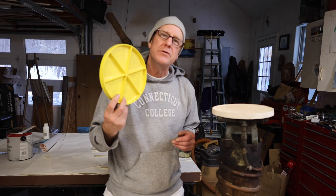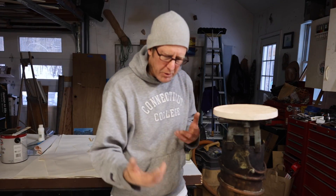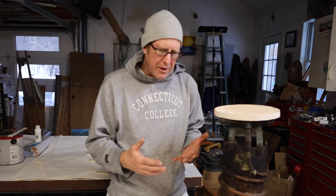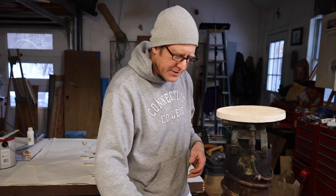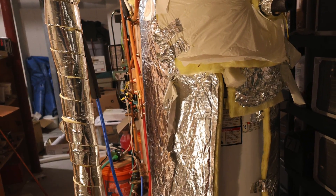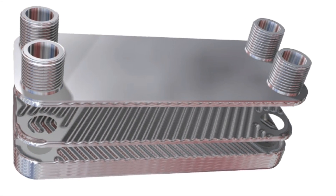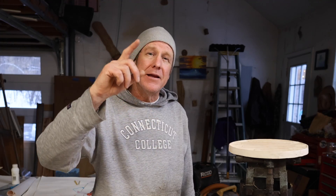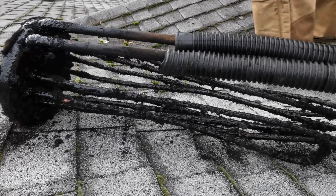This design I've been using since 2014 and I will use it until it breaks or I come up with something different. It works well enough that I have other projects way more pressing than trying to improve it. For the fluid heat exchanger, I'd recommend buying a plate-style fluid heat exchanger. Don't get it too big, because you want some heat left in that glycol as it goes through your chimney cap — that will decrease the amount of creosote buildup.